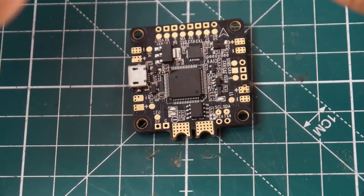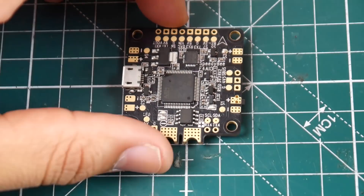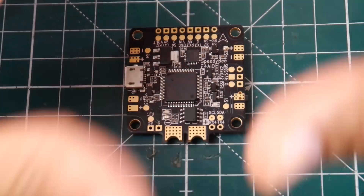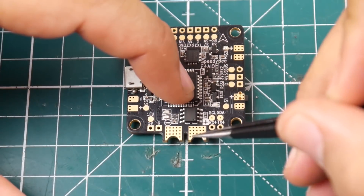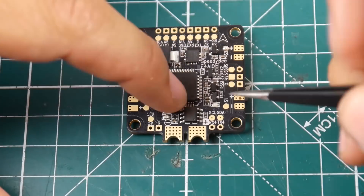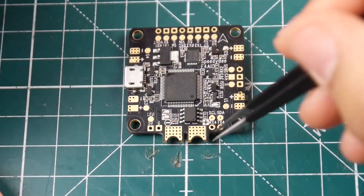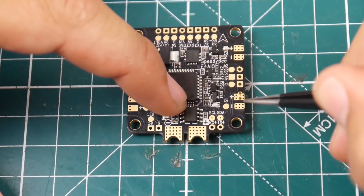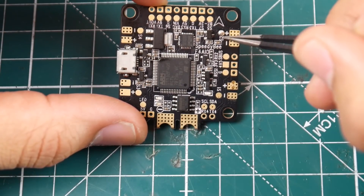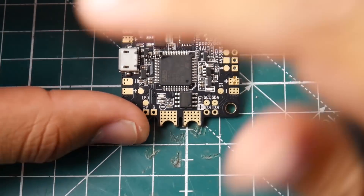This board not only has the 9-volt regulator, it's also an all-in-one flight controller with an F405 microcontroller unit — an F4 processor — and Bluetooth built in. Looking at the board, this is where your battery connects. We have S1 through S4 for motor orientation as per Betaflight standard. Here's the signal and power for your ESC. S2, S3, and S4 all check out correct. USB is on the left.